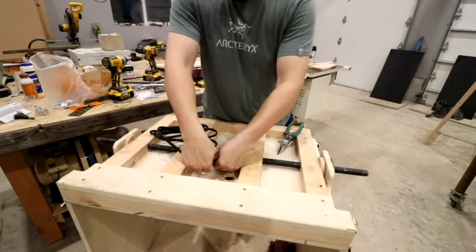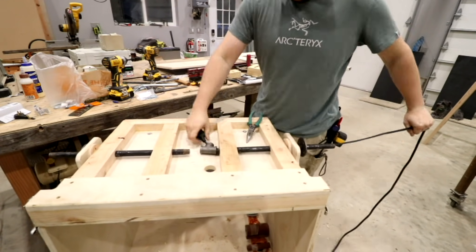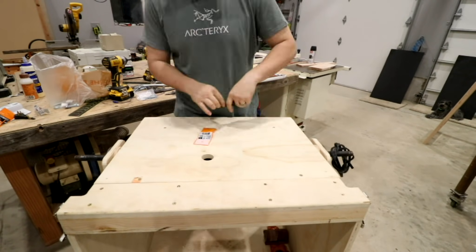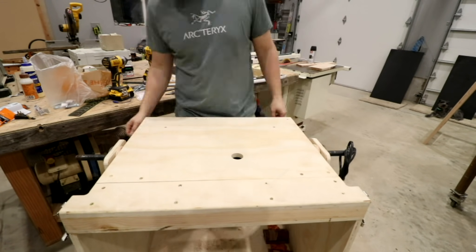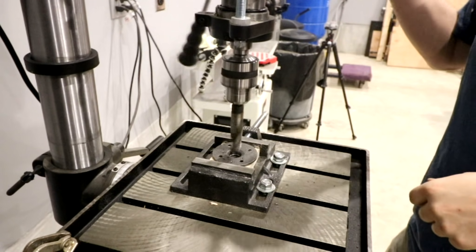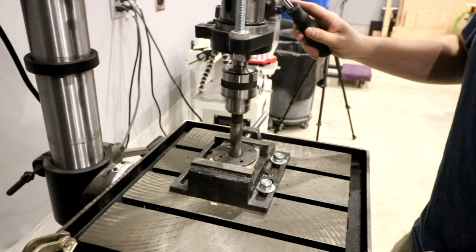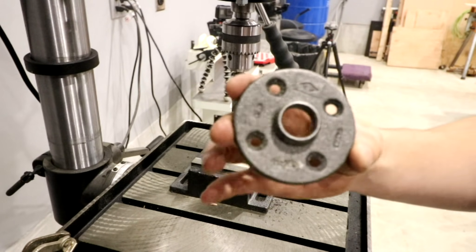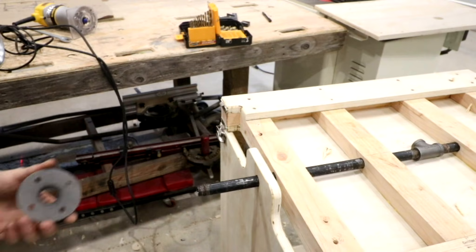As you see here, we're getting ready to start installing the electrical stuff — at least getting the wire run to do a check fit — so that we can go ahead and move on to getting the ends ready to go. After pounding the nutserts in on the other side, I moved on to marking out the three quarter inch steel schedule 80 pipe, and then I went ahead and drilled the threads out of a flange so that we can get it TIG brazed in place.